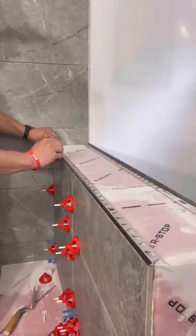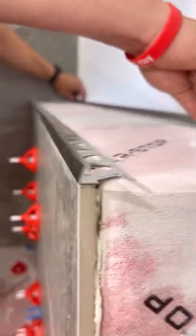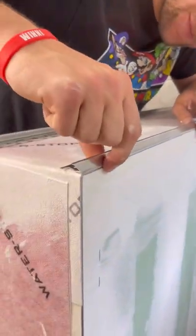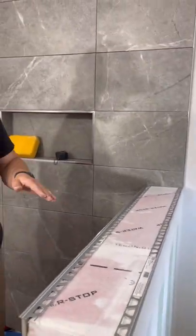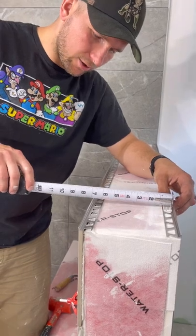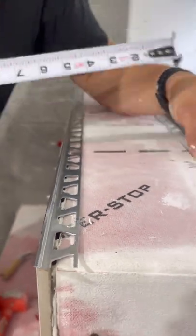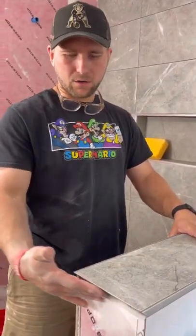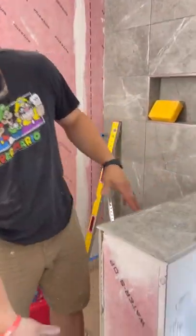We cut our two pieces. This one covers the top corner — see how nicely it's mitered to go down. And this one will run right along our edge here. I like to come out just a little bit, like a 16th of an inch, so we can do another coat of compound right underneath it. Now we're going to cut our side pieces and take the measurement for the pieces we need to batch cut for this entire side. We've got our first miter on here. I can't really measure my second miter until I start building this thing together, so we're going to start at the top, then the sides, and come to this point.